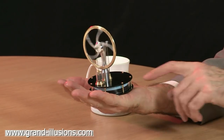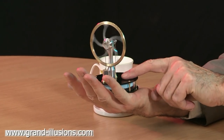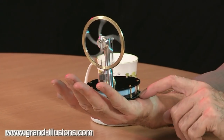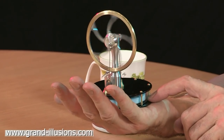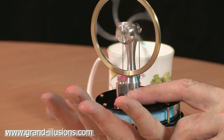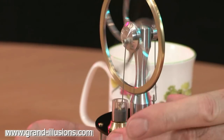We're getting a little displacer here - it's pushing the air up and down. When the air is in touch with the top plate, which is quite cool - this is the temperature of the room - it contracts. And when the air mixes with the bottom plate, which is quite hot now, instead of the heat of my hand, it's going to expand. The pressure of the air is pushing that piston up and down. It's worked beautifully, this.